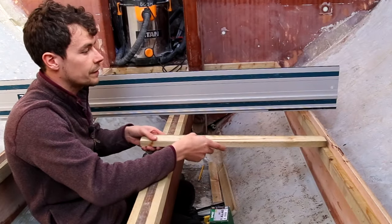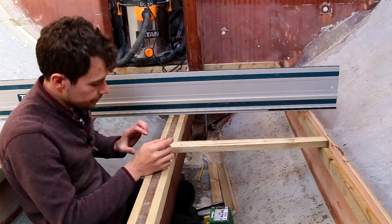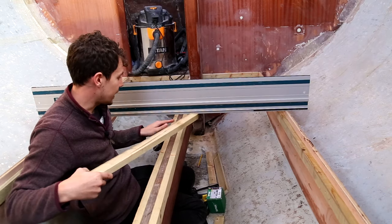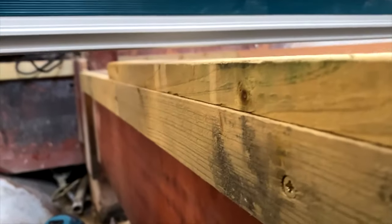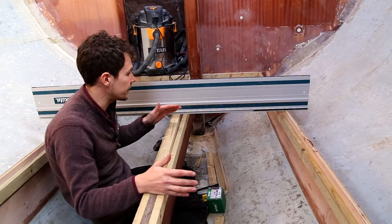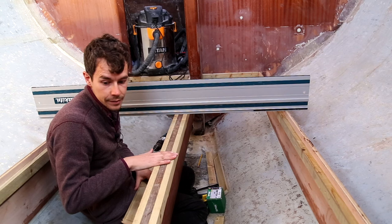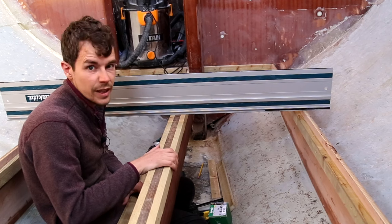So this beam sits across like this. It looks absolutely fine, it looks perfectly straight. However, when I put a straight line from the top of this support to that support and here, and I put the support where this is going to be, there's a 6mm gap, which is highly frustrating. So my options are to replace all this wood with actual 1 inch so that this adds up, or clad this out with 6mm, which might make it look a bit nicer, and kind of just call it a day there.